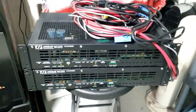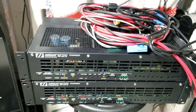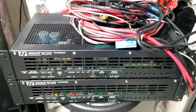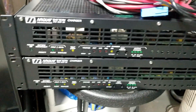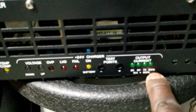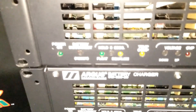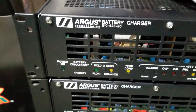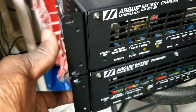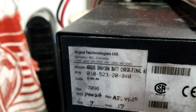You can set it for 12 or 24 volts with a jumper inside. It has Anderson connectors and a battery temperature sensor, which is advisable for this kind of battery. If you have a Magnum or Outback, the temperature sensor is great because if any battery is about to overheat or go bad, the system will back off from charging. The LED indicators show 25, 50, 75, 100 percent. It's a rack-mount unit — 18 to 19 inches — just like musical equipment.